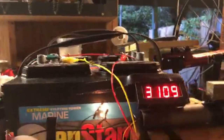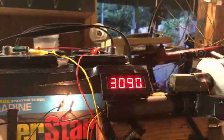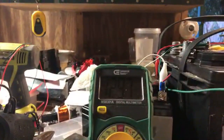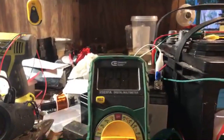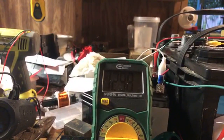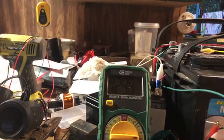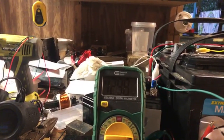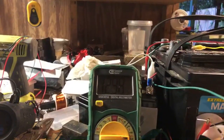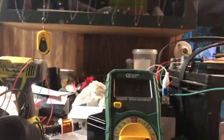Let's go up a little higher, look at the bulb. Look how bright that's getting. I don't see the speed climbing anymore. You can see the volts kicking up on the voltmeter there for that battery. We're at 9.2 going on 9.3, and you can see how slow it's moving. Now it's increasing when we turn that potentiometer. And we're gathering more back EMF by that potentiometer. Look at that. Take a pause there.